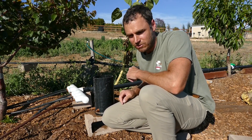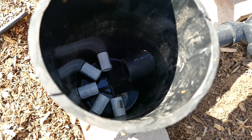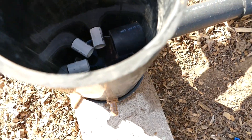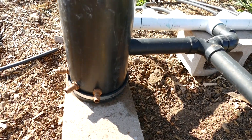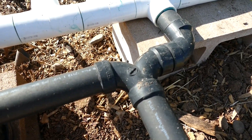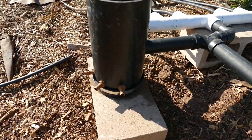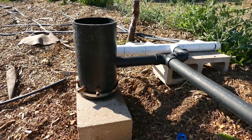Now I'm going to show you the other angle so you can see what I'm talking about. Down there you can see one inch-and-a-half black ABS line coming in and then five connectors down there — we'll test it and see if the flow goes evenly. From here you can see the double-L splitter coming in the side, which is the very important part to keep even, and there's the old-style one that's getting replaced. Now we're going to go ahead and test this by going inside and turning on the water and watching it come out.